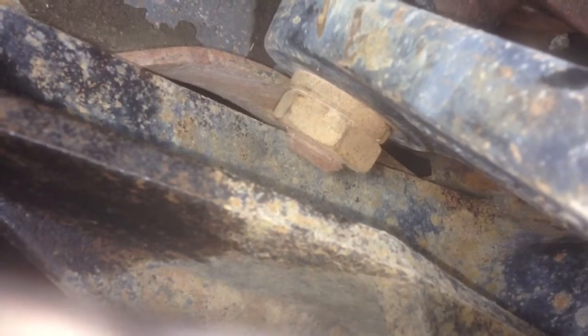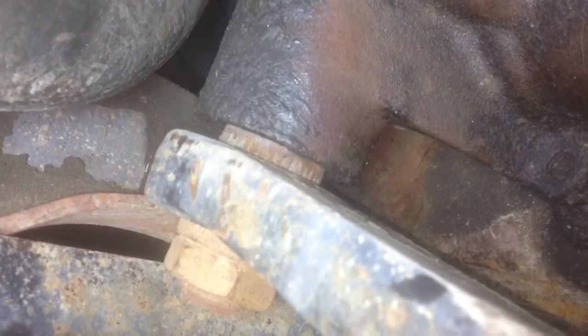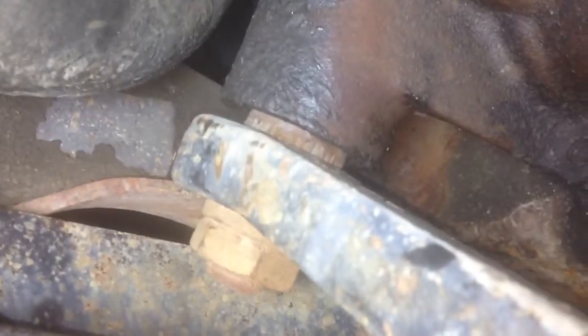Hey guys, little update here. Watch the shaft moving in the background — see it moving back and forth, not staying still. It's hard to see from up there because it's so close, but with my eyes not on video you can tell the shaft is bouncing around inside of the gearbox. We're not going to mess with reusing that, we're putting in new equipment.